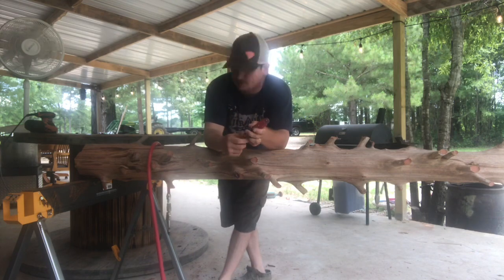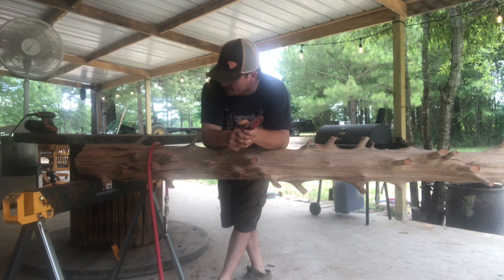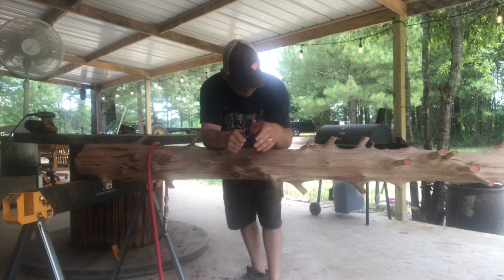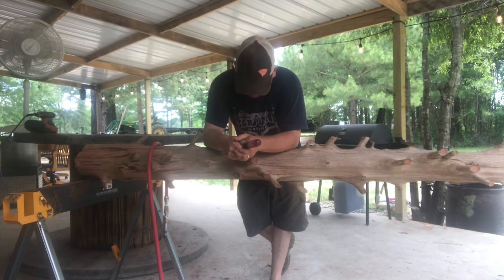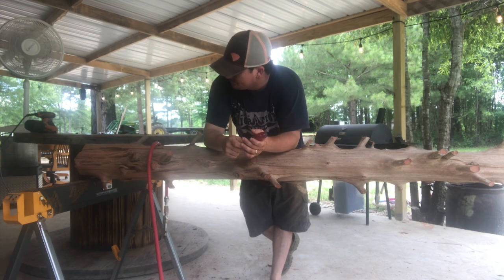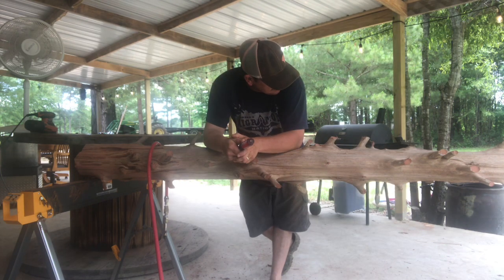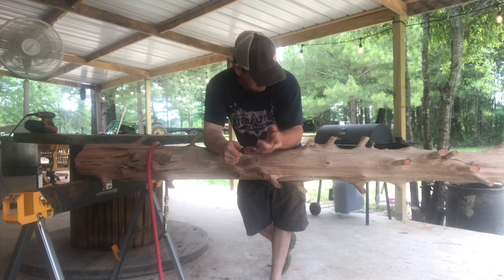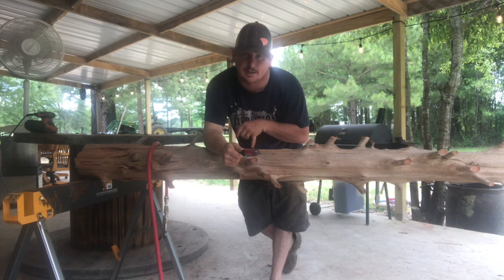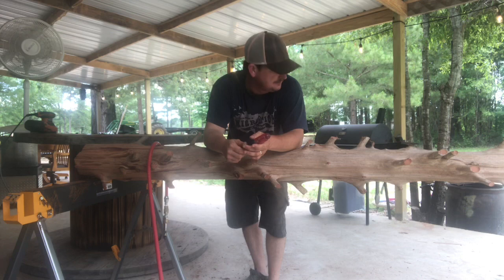I'm not going to worry too much about getting in there and sanding the rotted spots — if you had a little file you could, but I'm probably not going to bother with it. What I'm going to do is get my little orbital sander and start going down, trying to round off these limbs and get them smooth. You won't be able to get it all with an orbital sander — you are going to have to do some hand sanding with different size round sand blocks to get into the grooves and crevices. If there's a little spot you can't get into, that's just going to add contrast to the red and probably make it look better.